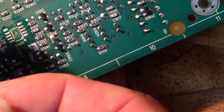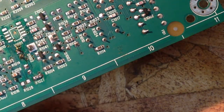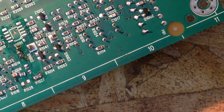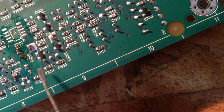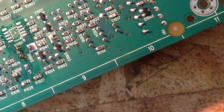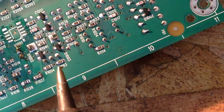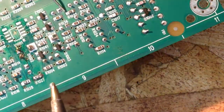We'll try not to dump this one on the table. Let's peel this back and see if I can get this one to dump out on the board — there we go. Right here is our resistor. Let's go ahead and slide it in place onto our pads. That looks fairly good. We'll even up this side and try to get it as straight as possible.